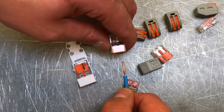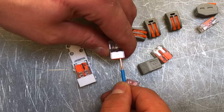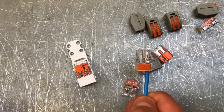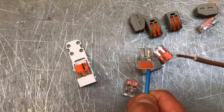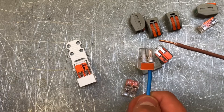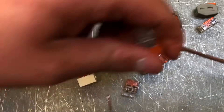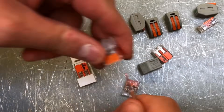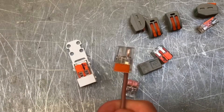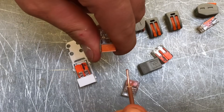Can you show me how easy it is to push a conductor into the 773-style WAGO connector? This is just a push fit — you simply push the conductor in and you can see that it's made the connection. However, I wanted it to be a line conductor and not a neutral. Can you get that one out for me? Are we going to snip it and chuck it away? Hopefully not. Just twist and pull, and it will simply come out. Same principle again — just twist and pull and they will come out.